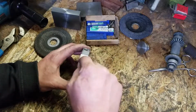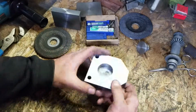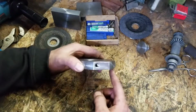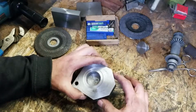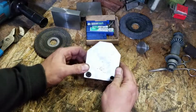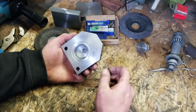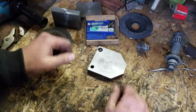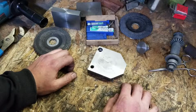What I'm going to do is center drill it, seeing as I've recently learned so much about tailstock support, and I have relieved the corners a bit with the grinder as well. I'm going to spin it into a taper so I can get two perfect 45s on either side, and it won't look all cockeyed like that, because I want this to look just bang on. I want it to look awesome. So that's the next part of my plan here.